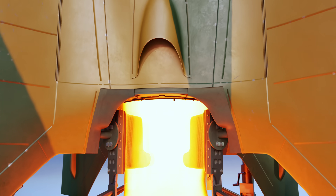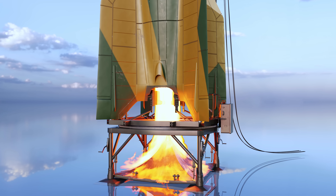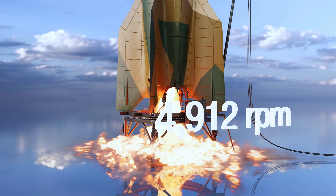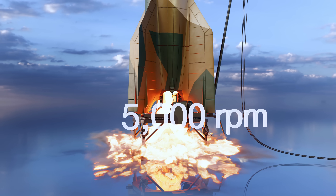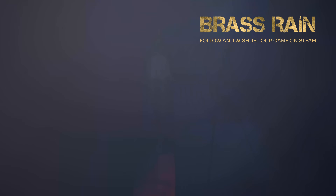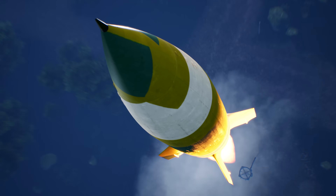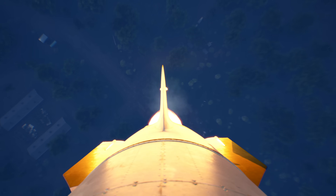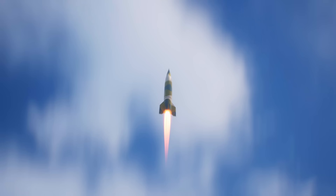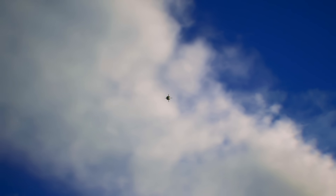Inside, the mixture was ignited and brought to 4,532 degrees Fahrenheit at a pressure of 15 bar. The ignition sequence did not produce enough power to launch the rocket — it only served to confirm the engine was working properly. If everything was in order, a switch was activated for the turbopump to increase its speed to 5,000 rpm, causing the engine to produce a thrust of 55,000 pounds. The electrical cables would disconnect electromagnetically and the rocket would lift from the ground. The fuel and liquid oxygen allowed the engine to burn for no more than 70 seconds, reaching a maximum thrust of 64,000 pounds and a speed of 3,580 mph — just under five times the speed of sound.